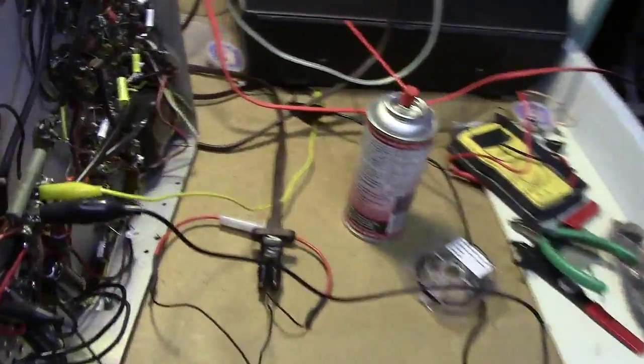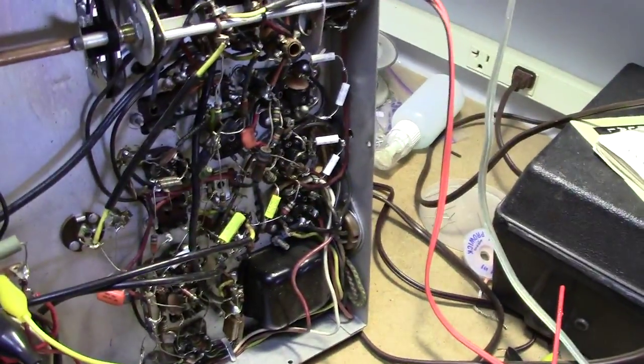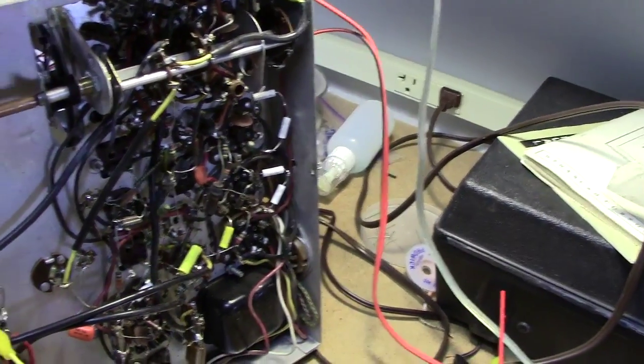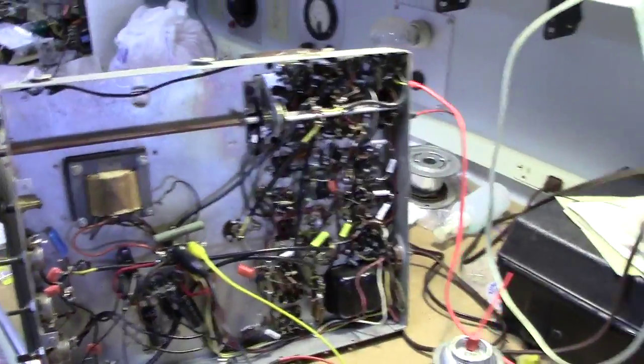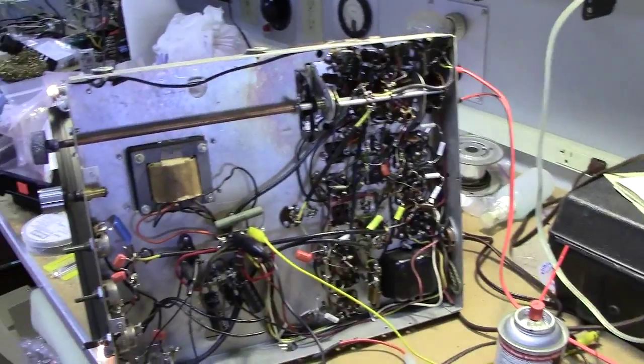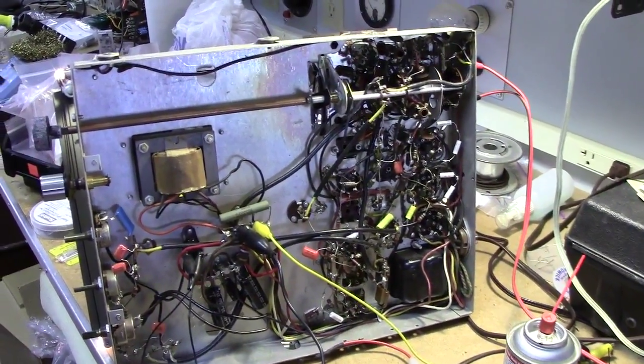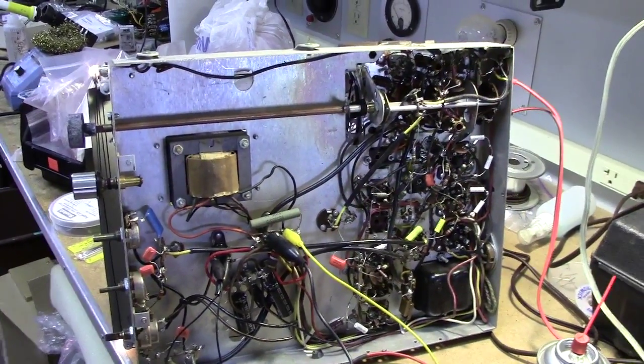So we'll take those cans apart. We'll use 22 picofarad new silver mica caps for FM and 100 picofarad for AM, and we'll rebuild those cans and then come back and give a demonstration of it. The performance always seems to increase as well when that's done.